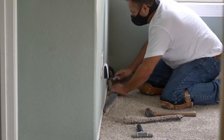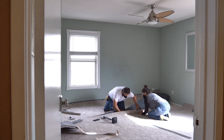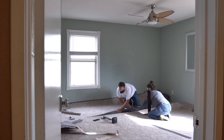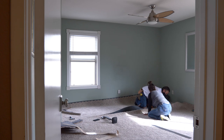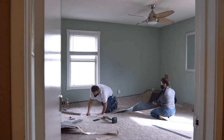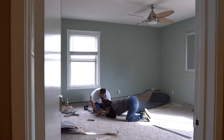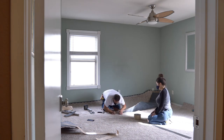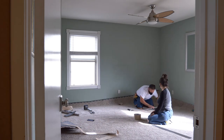Since the carpet is attached to the pad, the pad and the carpet are one — the carpet is not going to move. I was a little concerned about it bunching up, but that's not the case. It's actually hard to just move the carpet on the subfloor without the tape. He's finishing up the seam — you only pull the tape when you're in that section, making sure the tape covers both sides so the seam is flawless.